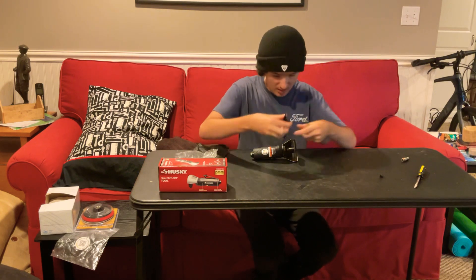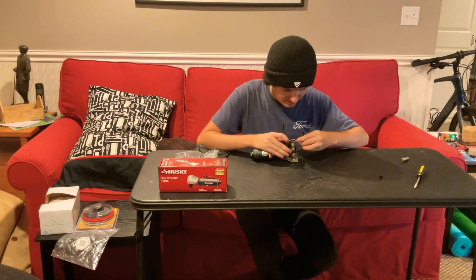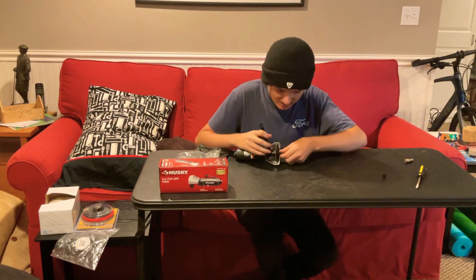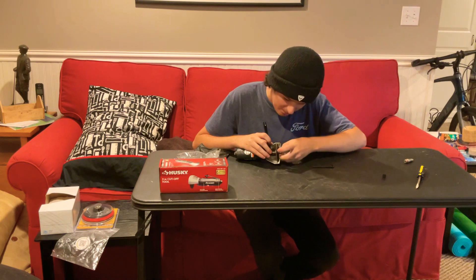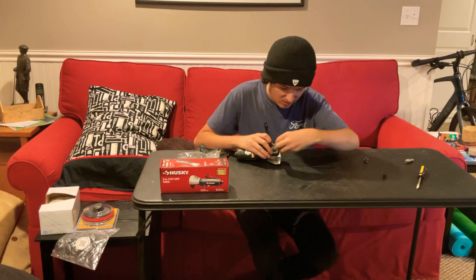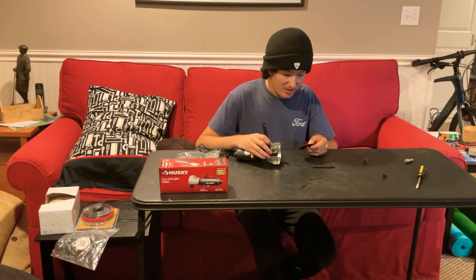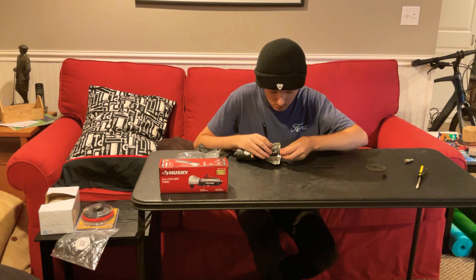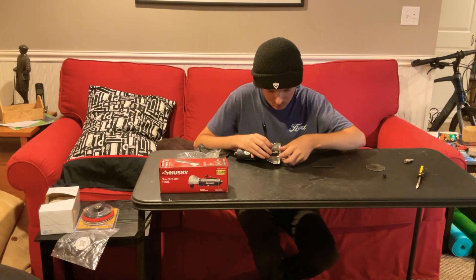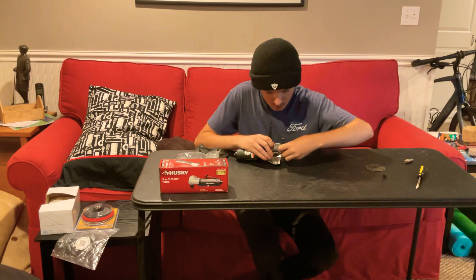You take the smaller end of the wrench and stick it in here. Hold this with one hand, and use the other hand with the allen key. That was tight — loosen this all the way. It's normal thread, I believe. Then you take this wheel and pop it off. This wheel is a nice wheel — it's Taiwan made, three by one-sixteenth by three-eighths. It says: do not use unguarded tools, wear safety goggles, and special max 25,000 RPM. Then you put the new wheel on — just snug.